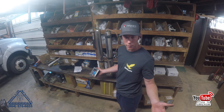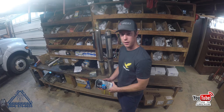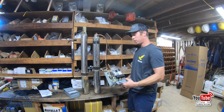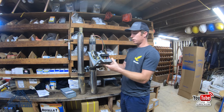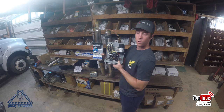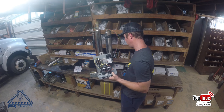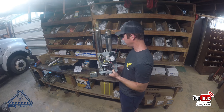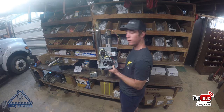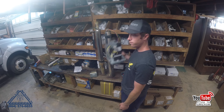A lot of you are thinking, why don't they make all motors two-wire? And we're talking about small residential single-phase motors here. The reason is it gets to a point where pump manufacturers just can't do it. This is a two-horsepower control box — you can see there are a lot more components on it. The same goes for bigger motors. At horsepowers above 1.5, it's just not physically or economically feasible to put these components down in the motor. So when you go to two horsepower and above for single-phase applications, your control box will be up at your house site or at the well.